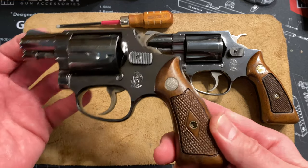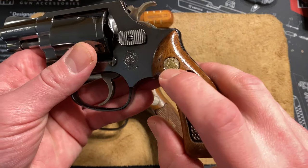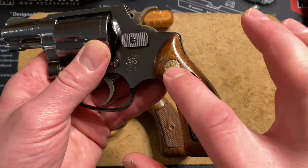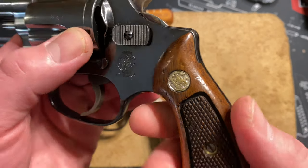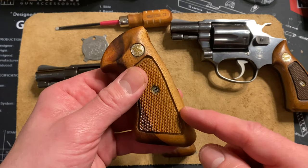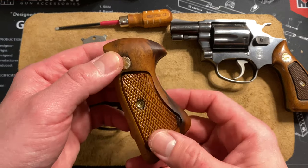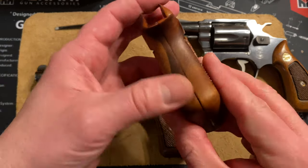I need to do a little polishing, and if you notice there's a little difference here — there's some brass there. You can polish them up and then take some 600-grit sandpaper, very carefully, and sand that down to get a brass finish and kind of two-tone your grips. These are the target grips right here — they'll go on a square or round butt. I've had these on the model 37 round butt. These target grips run about a hundred-something bucks on eBay right now.